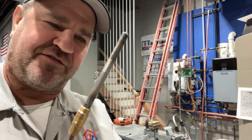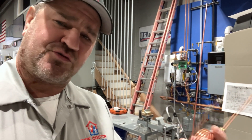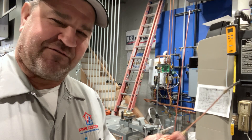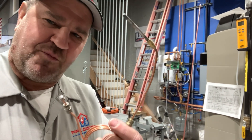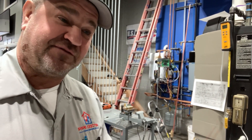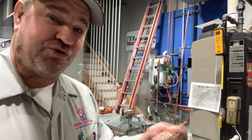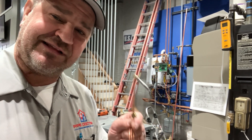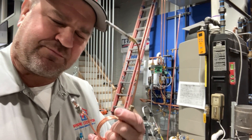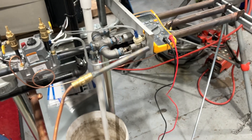When you're servicing a heating system or water heater and you come across a thermocouple, test it like we just did. If it's reading under 15 or 20 millivolts, recommend replacement — because what's going to happen is the next day, next week, next month, or next year you're going to have a nuisance no-heat or no-hot-water call. You won't be able to relight the pilot. Either they wait until it fails — resulting in a callback — or you make them aware. Recommend it, put it in writing, and if they decline, it's documented.